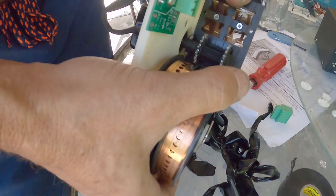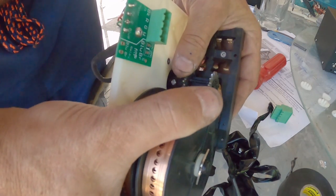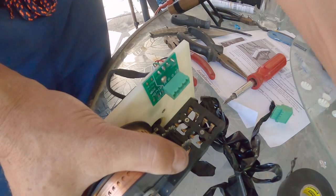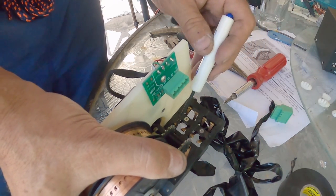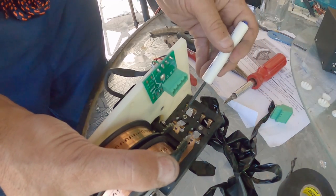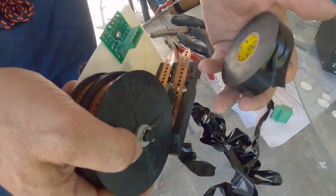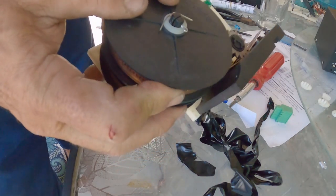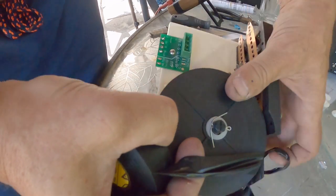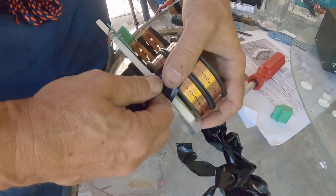Two hands on it — slowly and carefully back the tape out and run them together simultaneously through there. The top one goes in the top sprocket; the bottom tape goes into the bottom sprocket. As they get in here, they're going to catch, so we have to fish them out until it slides through. A little screwdriver will work to lift it up just slightly to get it over the edge of that plastic and over the little prongs. Once we get it just past the end of the black plastic, tape the whole thing so it doesn't get away from us. Take about three or four turns around this spool — that'll hold it in place if you tape it fairly tight and snug.